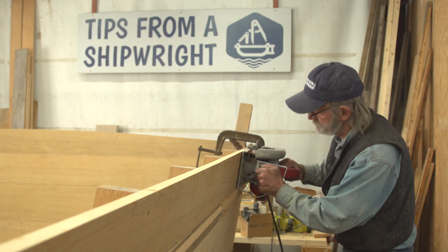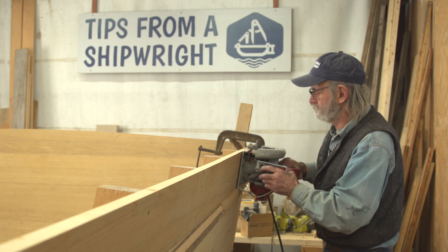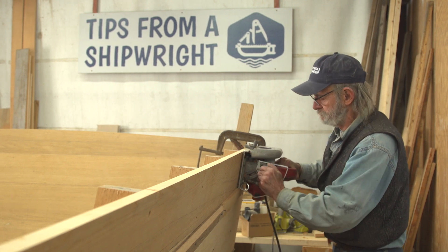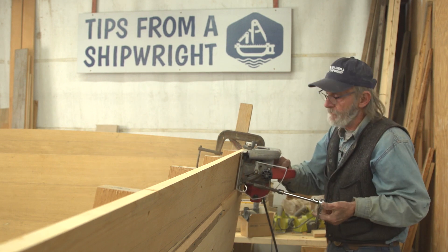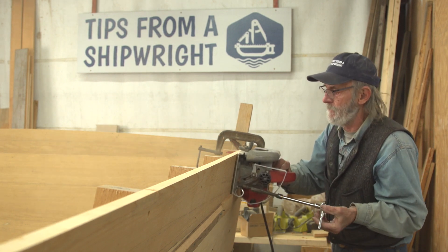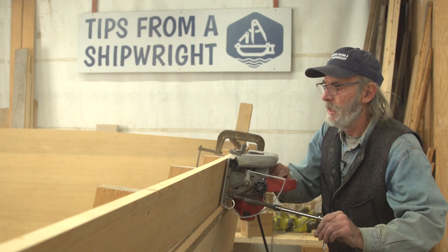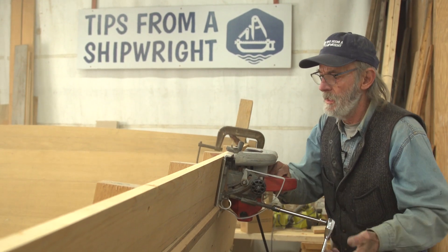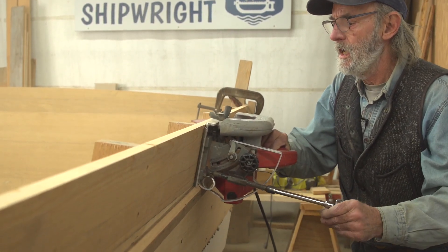It's just not like an ordinary plunge cut because the saw is on an angle. If I tried to plunge cut it from the table on the work and then hinge it in, it won't work — it'll just bind up. So I'm plunging it on its own tracks; it just happens to be set up that way that I'm able to do it. And once I've got it in there at full depth, I start going along and you can see me changing the angle on the saw as I cut.